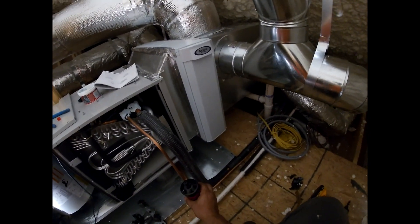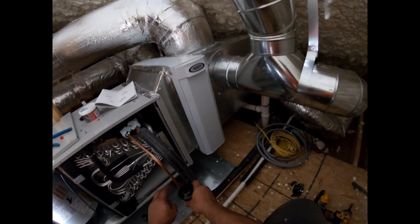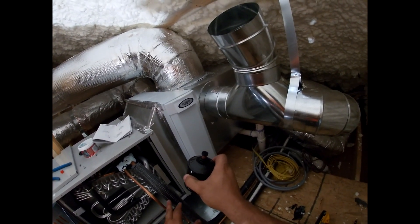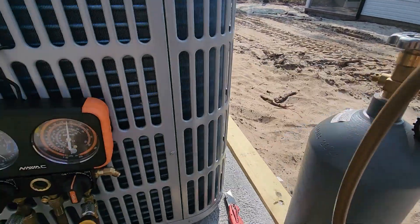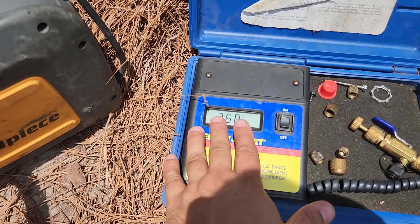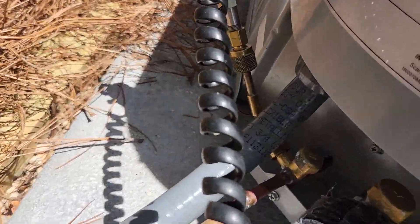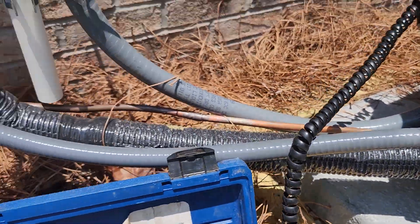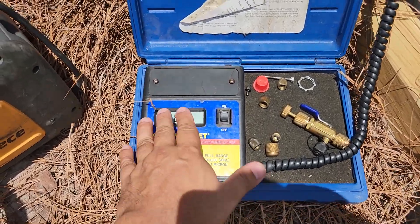On my air handler, I had to flip my coil because I would be installing it as a horizontal left configuration. I like to go ahead and hook up my liquid line as if I were not putting in a dryer, but leave space for the dryer, then pick a spot and cut it out. You can also run the liquid line close to the suction line and then dogleg out and back in — that's another way to do it, but it seemed like more trouble than it was worth. I did a pressure test on all my field joints in the evaporator coil and it held at well over 350 PSI. A few minutes later we were down to 268 microns, which is great. The micron gauge was on the opposite end of the piping system from where we were pulling the vacuum, reading all through the line sets, through the air handler coil, and back — that's really the ideal location for worst-case scenario microns.